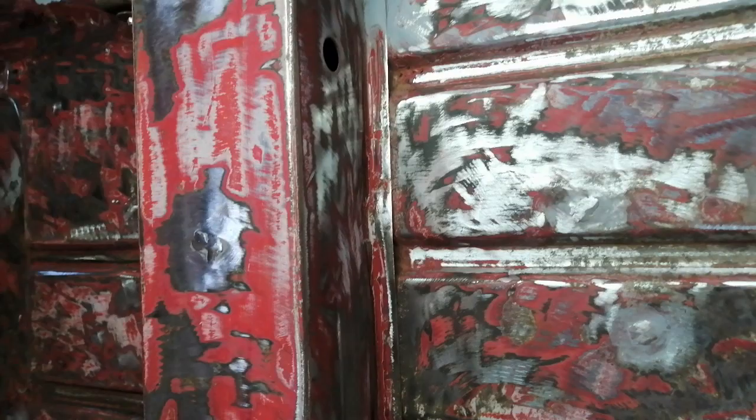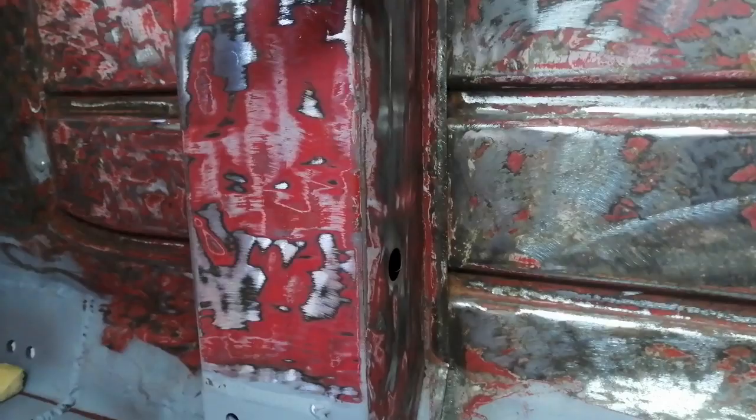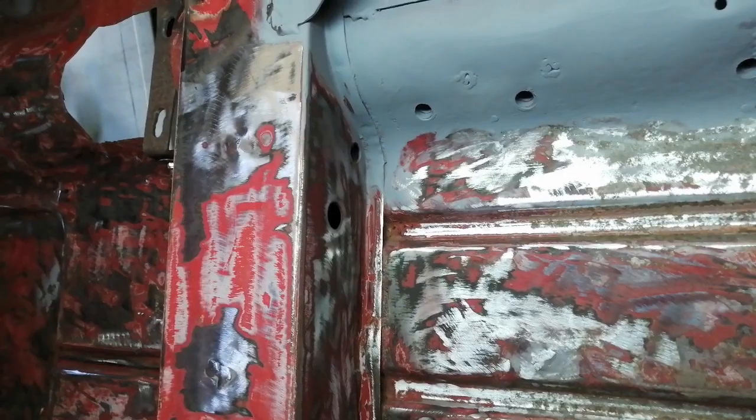While I'm in this area, I noticed I have yet to stitch weld the main seat base to the floor. This car is an ex-rallycross car — it does get abused. The floor pan does hit the floor. Our panel beater beat out quite a few dents. Look at this one — it literally turned this little channel inside out from how hard it hit the floor, and those sort of stresses actually pop the spot welds out.